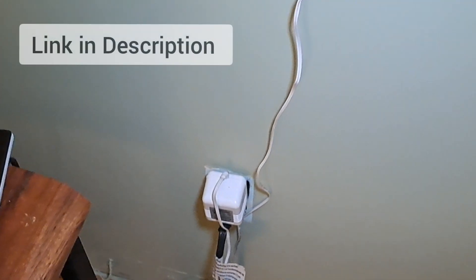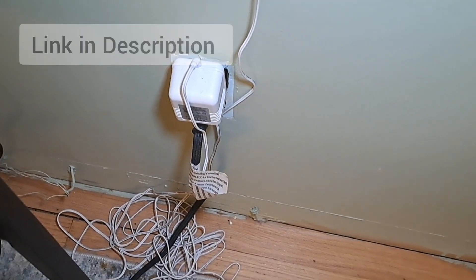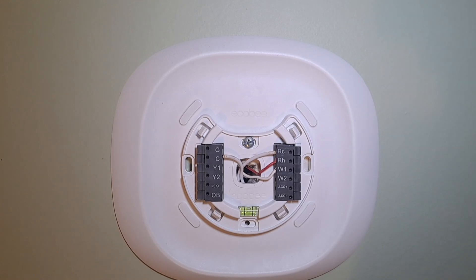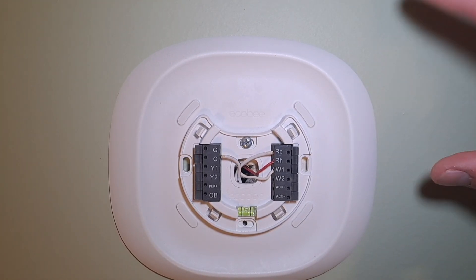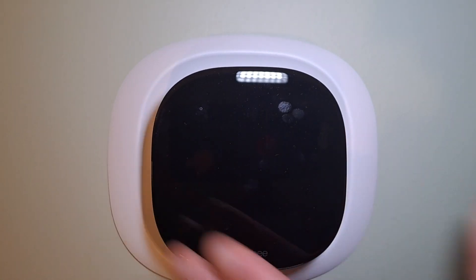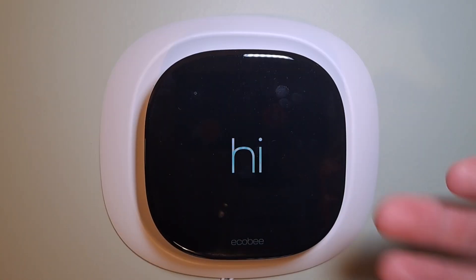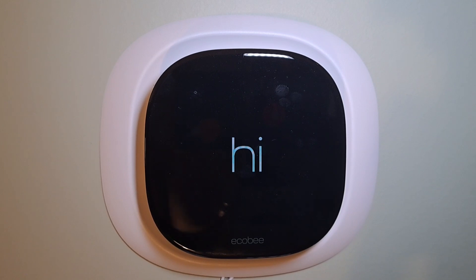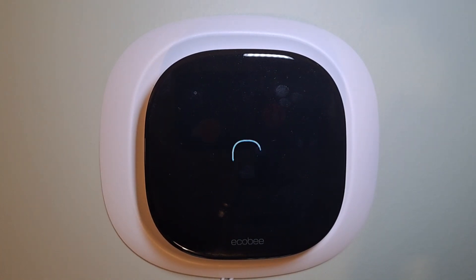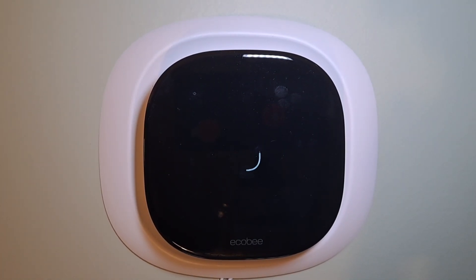This is where my plug goes in — you can see there's a bunch of extra wire in there, so you've actually got a long distance to run if you get the specific one I'll leave linked in the description below. I'll figure out how to make the wire look a little neater in the future, but for now the Ecobee works, powers right up, and I can control my heating from here or on my phone. If you've got a two-wire setup and you're looking to install a smart thermostat with constant power, this is the way to do it.